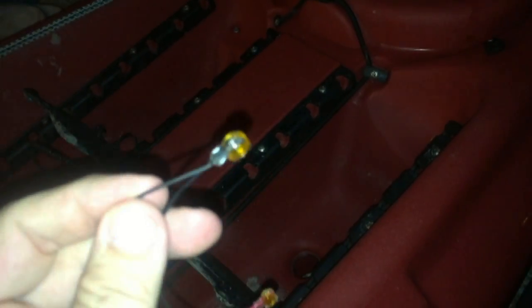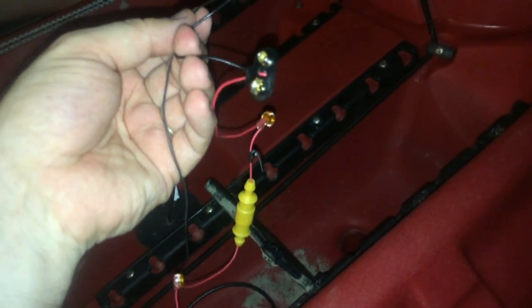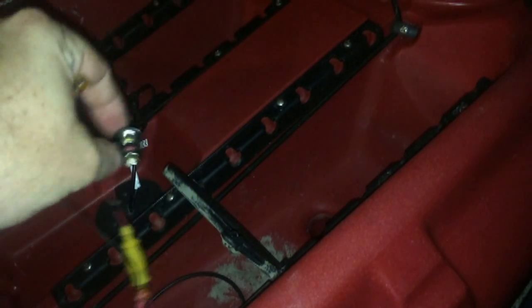I have also already run, as you can see, both cables are here. One's the power cable. And here's what those little clasps are for, for making your connection. You just stick them in there, you crimp it down, and it's filled with silicone. That takes care of all your connections for your battery. They are waterproof. And you've got your 9-volt connector here.